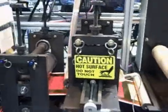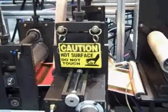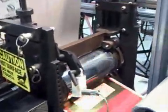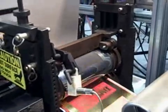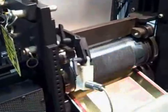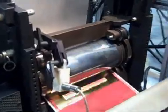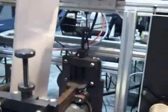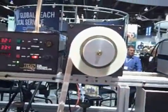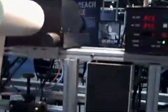At our third die station, we're using a second DMS hot stamping unit, and we're using a special die called a cold pocket die, and we're selectively hot laminating this piece, meaning we're laminating everything except for the photograph window. And you can see on the die there's an area that's gray, and that is a cold area that's not heated. We're unwinding our film, our polyester and polyethylene film from another DMS auxiliary unwind or rewind.